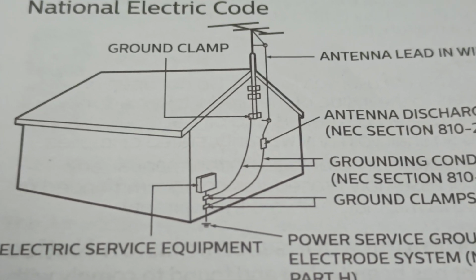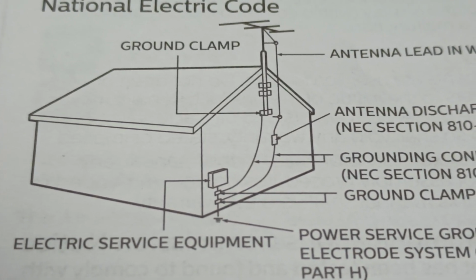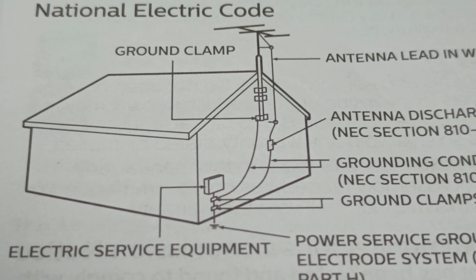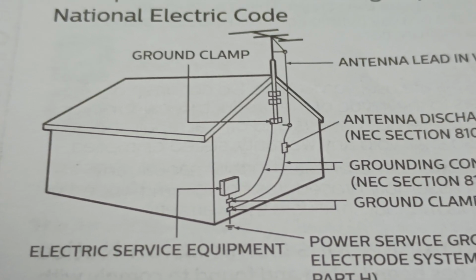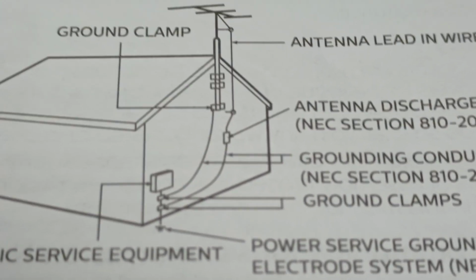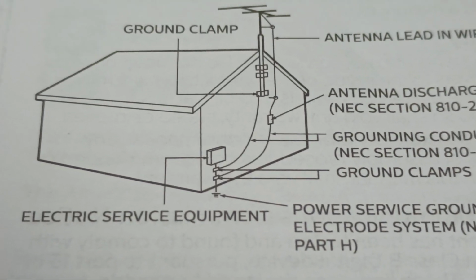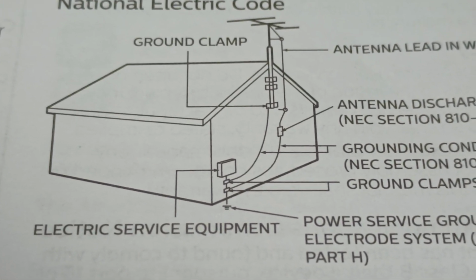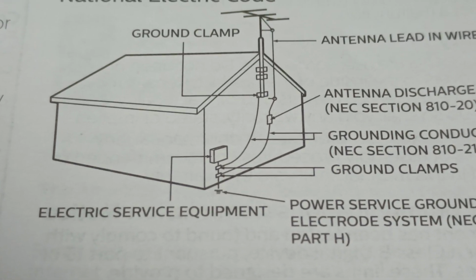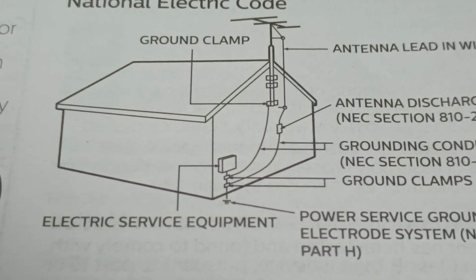Doesn't matter what ARRL told you, they're wrong, and they are not an authority. This is not a radio topic. It's a life safety, lightning, power line safety issue, not a radio topic. There's nothing radio about this grounding system, except that when a lightning transient hits, the frequencies are RF. And there's your diagram. People want a diagram? There it is. No separate ground rod is permitted.